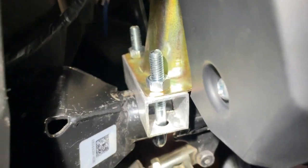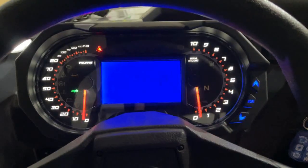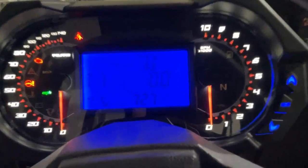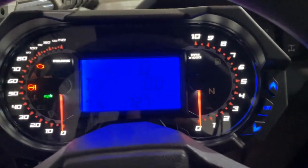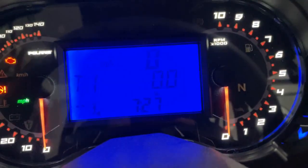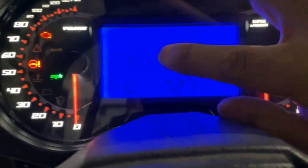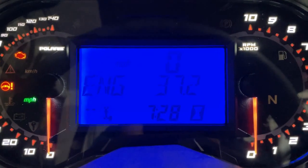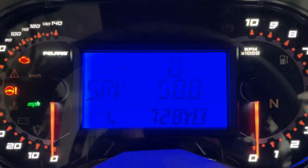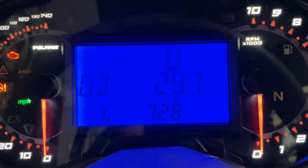Now that it's bolted down you can see the final product. Let's fire this thing up — turn the key on and watch it cycle through the gauges on startup and bring us to the main screen. Disregard the check engine light and power steering light — those will go off when you start the machine. The up and down arrows change what's displayed in the info menu: trip one, trip two, battery volts, engine hours, service intervals — it'll tell you when to perform your next service and you can update that — plus engine coolant temperature and odometer reading.